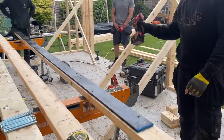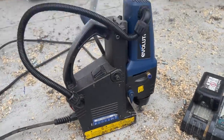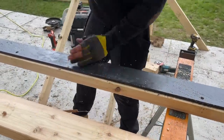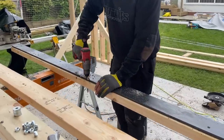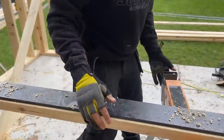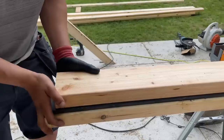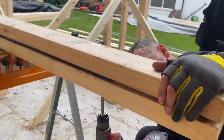We've pre-drilled the steel already using a mag drill - literally what it says, it's a magnetic drill, you switch it on, a magnet fixes it to the steel, and then you drill it with a rotary broach bit. We've been using 10mm. Now the steel is held in place, I'm going to drill all those holes I've already pre-drilled through to the timber below. The reason I haven't put two bits of timber under there beforehand is simply because a lot of the timbers have got twists in them.